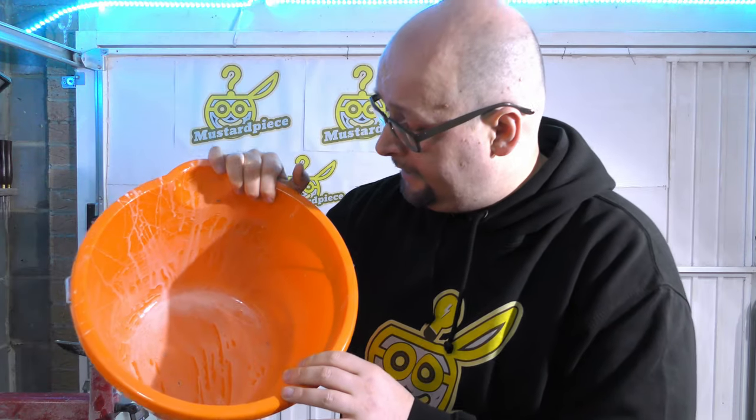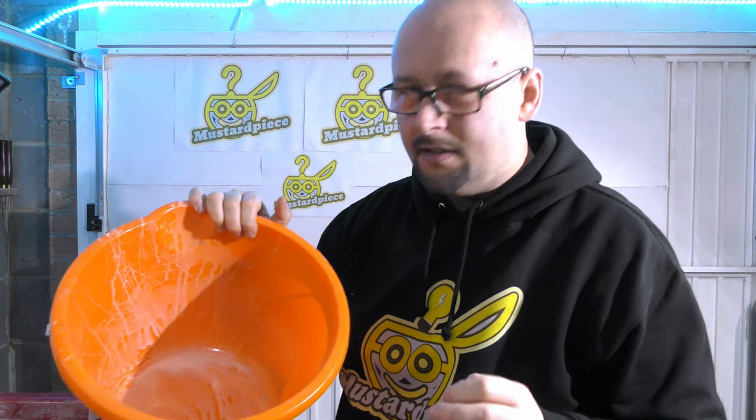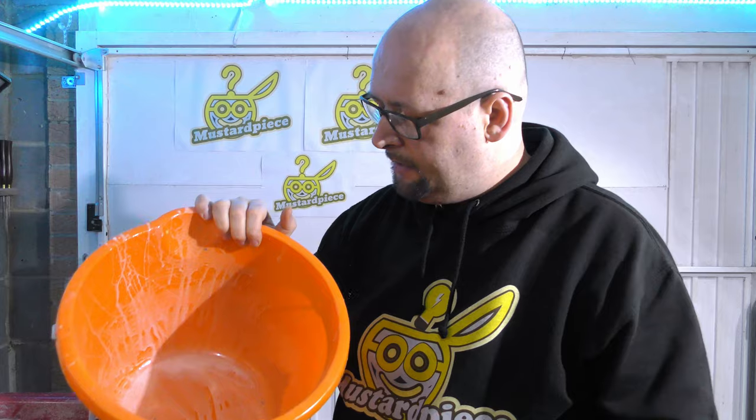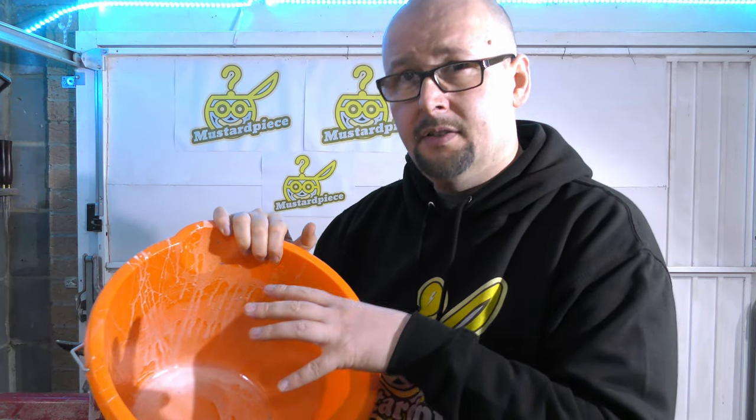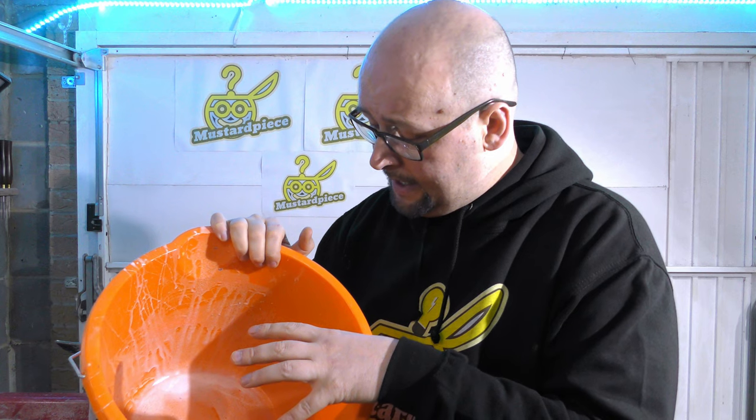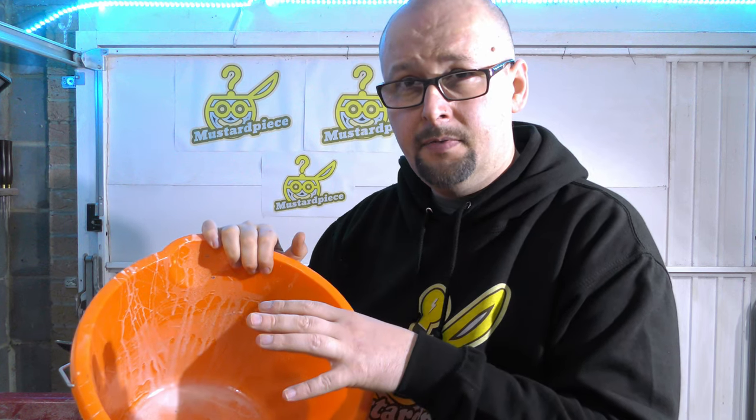Okay, I have an idea. So basically, I don't have a vacuum chamber, so I would get lots of bubbles. So I figured I'd put all the pieces of wood into this bucket, pour some epoxy on top of it, and just let it soak for an hour. Before it sets, I put it back into the mold, and in this way I will seal the wood and hopefully bubbles from the wood are not going to rise into the epoxy.